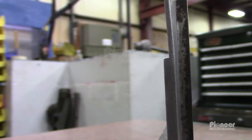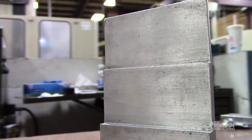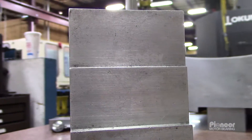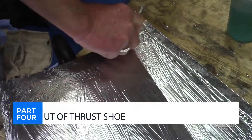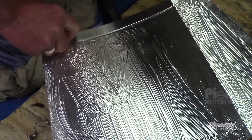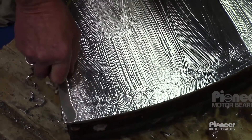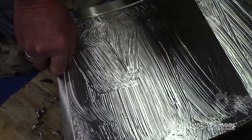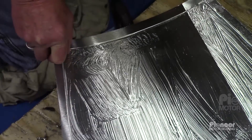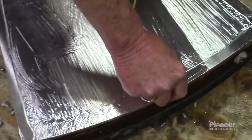This test block has a section of uniform babbit thickness, partially bonded to steel and partially open. The open region generates a strong reflection. The test block shows the inspection of a simple case where there is a uniform back wall reflection and the potential for bond line reflection indicating poor bond integrity. An actual thrust bearing can have features which create variation.